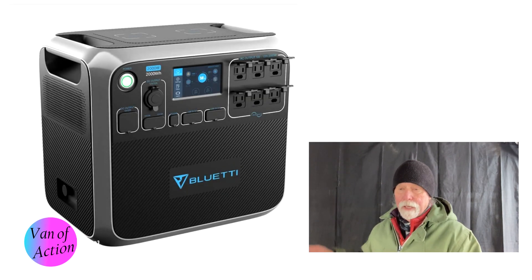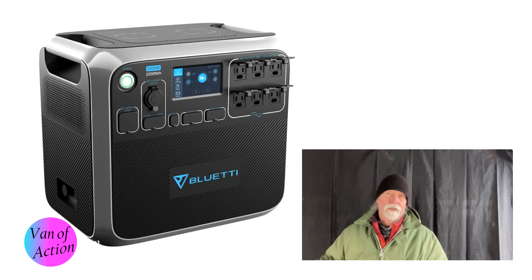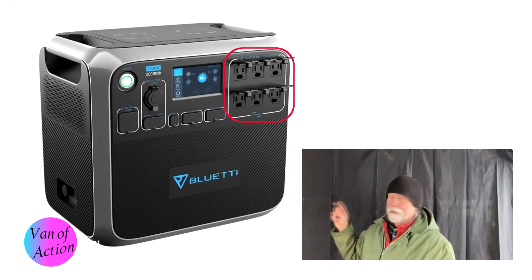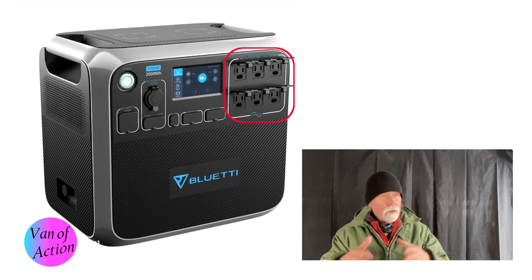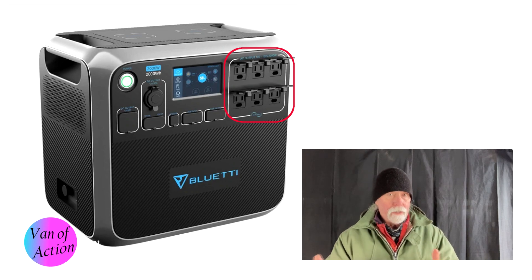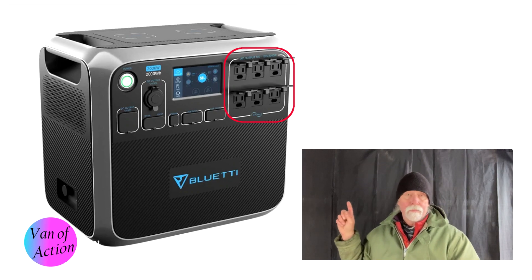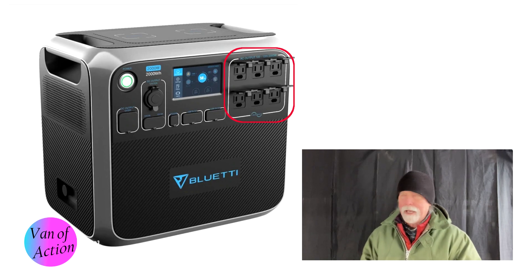It's a great-looking system. I'm measuring the Bluetti's capabilities against the requirements I personally need to be satisfied in my van — the product looks absolutely spectacular, the question is just whether it works for what I want. All the plugs are on the front, and there are a ton of them: six three-prong 20-amp plugs. In a regular North American household a wall outlet is on a 15-amp circuit, so having six plugs each at 20 amps is just massive capacity.